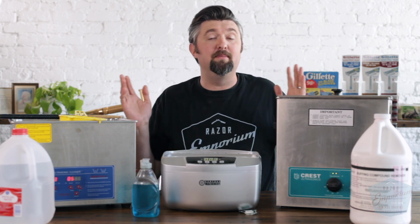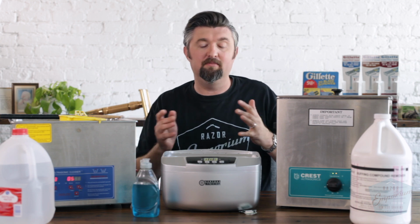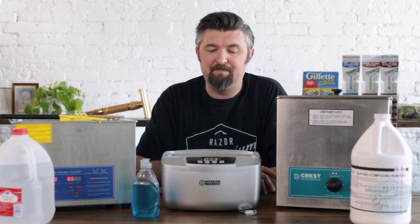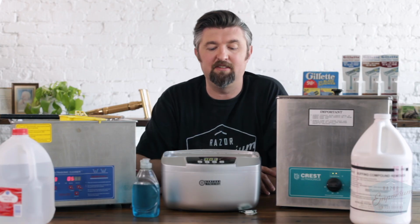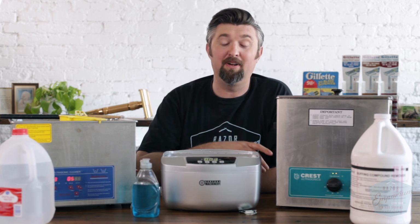So another thing to mention is that ultrasonic cleaning is not supposed to be an hour-long process or even 20-minute-long process. It's just supposed to be a few minutes. That's what the instructions say. That's what popular advice would tell you. So another kind of credence that this should not be your only cleaning methodology. This should be a last step, because if you expect it to go in looking horrible and coming out looking perfect, you'll probably be disappointed.